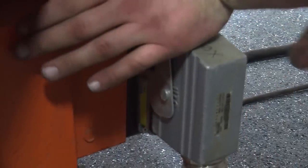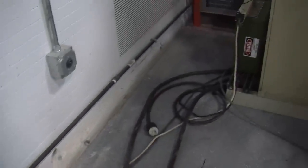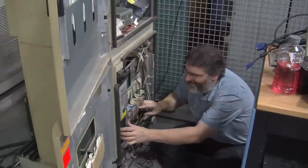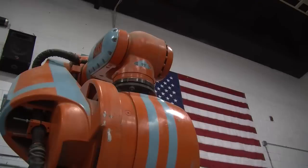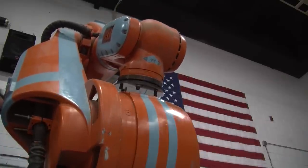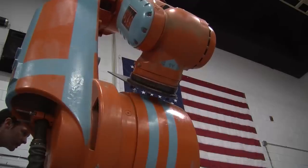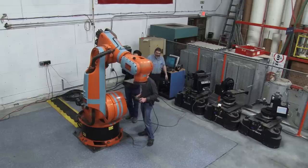Here is our KUKA KR350-1 robot, which we call project Jeff. You can see the holes — there are two on each side that actually anchor the robot to the base plate. To get everything to fit, the robot has to be aligned plus or minus maybe 30 thousandths of an inch. This is not an easy task with a robot that weighs 1,800 kilograms that you have to shove around with a forklift. All of the electrical connections go together in our beautiful new raceway in order to protect the cables moving along the floor behind the robot. For the first time in three years, project Jeff moves again. The first step is to set the mastering for all of the axes.